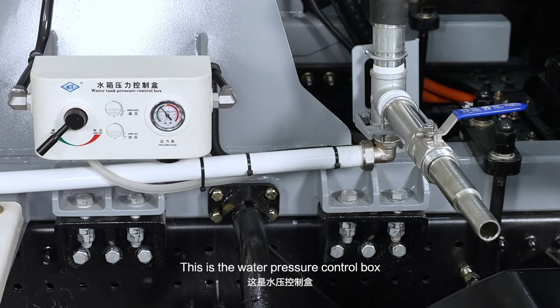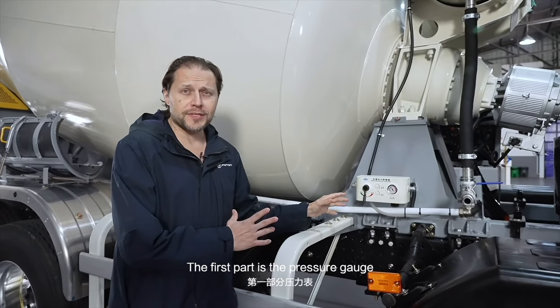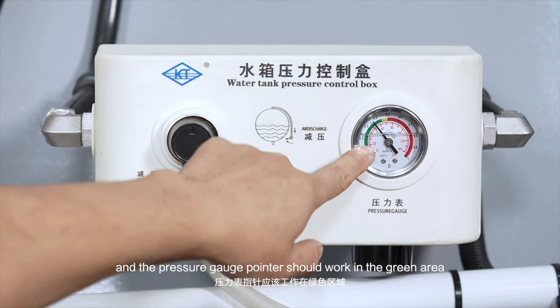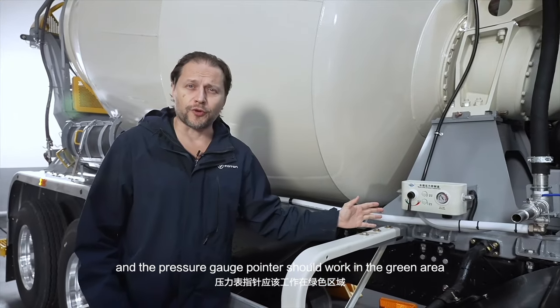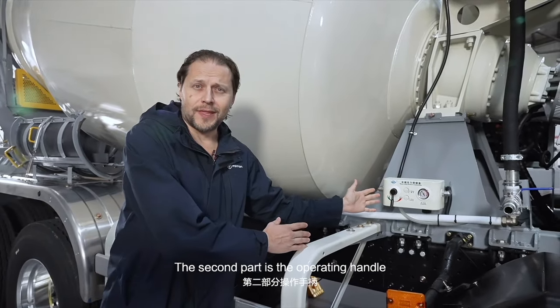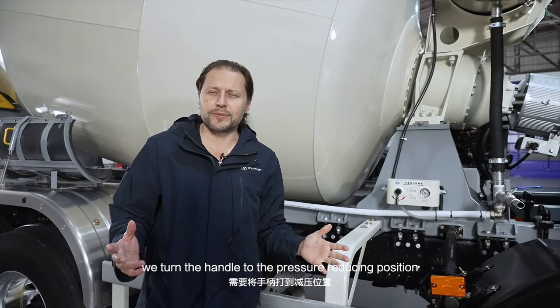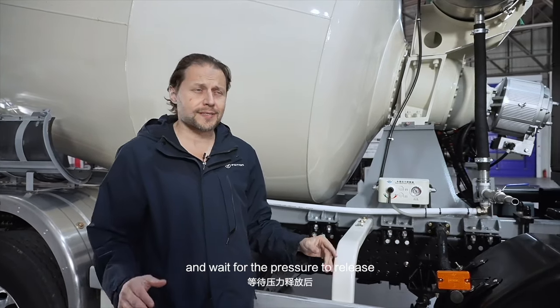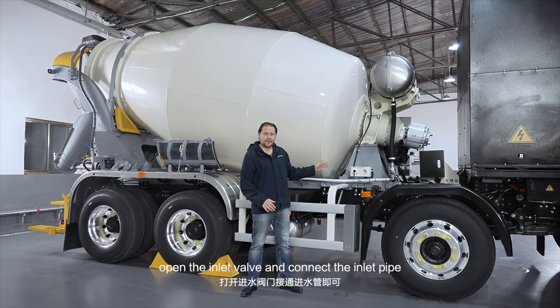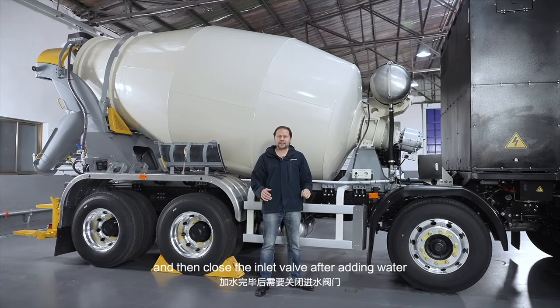This is the water pressure control box, which consists of two parts. The first part is the pressure gauge, and the pressure gauge pointer should work in the green area. The second part is the operating handle. When we need to add water to the system, we turn the handle to the pressure reducing position and wait for the pressure to release, open the inlet valve and connect the inlet pipe, and then close the inlet valve